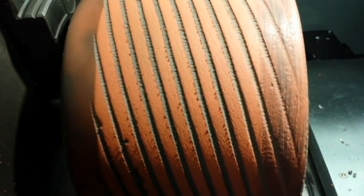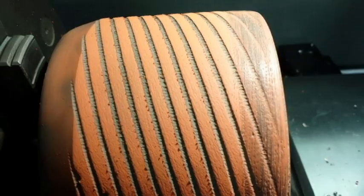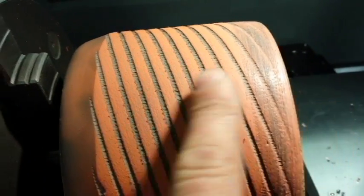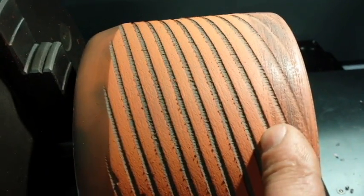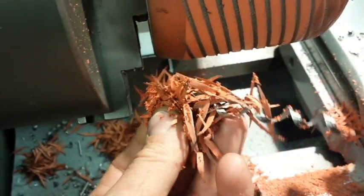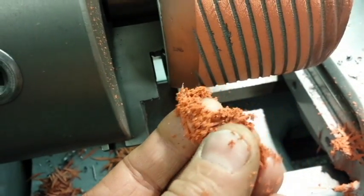First pass — if you look at it there, it's a pretty good finish. Since the contact wheel was not even, I've only cut from here to here so far, and you can actually see that the finish is pretty nice. I did one rough cut where I was able to pick up some pretty big shavings, and a very fine cut — we're talking like 2 thou per revolution and maybe 10 thou depth of cut.